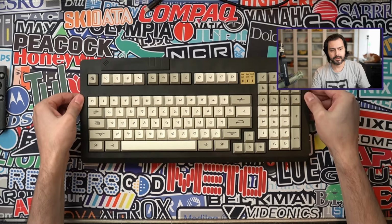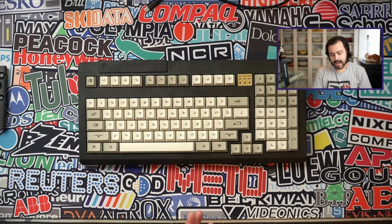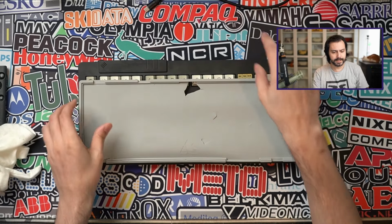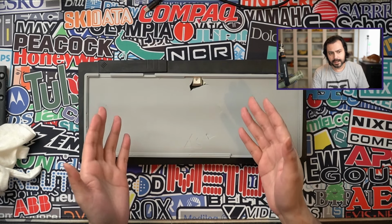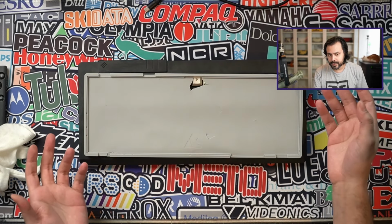All right, so when I originally got this board, I learned that building it plateless was an option. So immediately I was like, hey, I'm gonna build this plateless. See, silly me thought that plateless meant the PCB would mount to the case. It does not. Plateless works by having a piece of silicone. This one has been destroyed by someone, but this would go under the PCB, and then the PCB would sit on top of the silicone, aka stack foam mount, which is disappointing. By the time I realized that it was stack mount, I had already soldered everything, so we just committed to it.